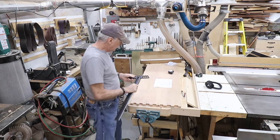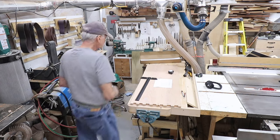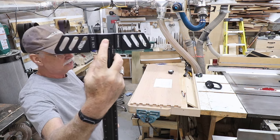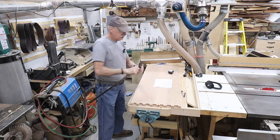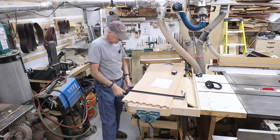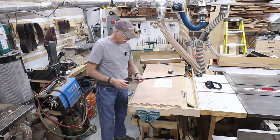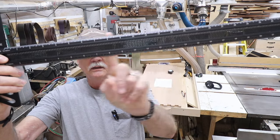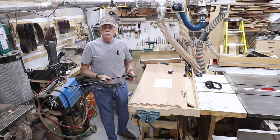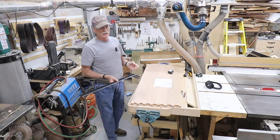This is the inch model, so it's all inches. It comes with little color instructions you can actually read and understand. It even gives you the order in which you tighten these flatheads to put the T onto the bar. It has that shoulder right there — when you put it on your work piece, it can't tip this way or that way. It's solid. Some of them don't have that. One of the interesting bits is these holes, which are incremented in one-thirty-second of an inch and they're good for up to a 1mm pencil. I use 0.7mm pencils — 0.5mm are just a bit too fragile for wood, but 0.7 seems to work out fine.